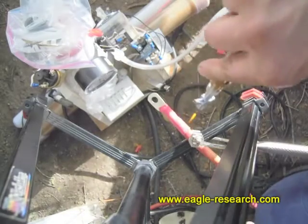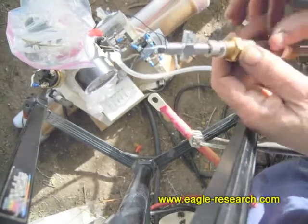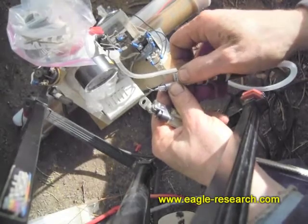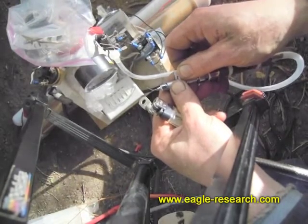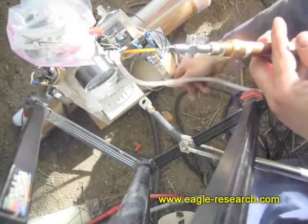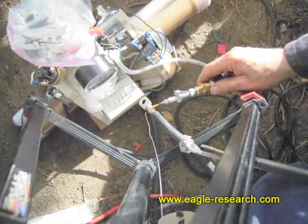When you're doing the heat shrink, of course you want to have the torch quite a ways away from the material - just like that, done. And here we go again, we're just going to finish soldering this negative terminal now. So first I turn on the gas to the maximum velocity that I can get without losing pressure, which is right there, and then light the flame. We're going to put that solder there - just get some solder ready and start heating that terminal end.